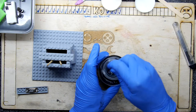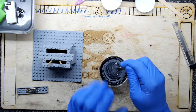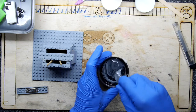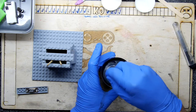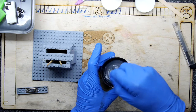And then the other thing is called a pressure chamber. You have to put the whole piece, so you put the whole lot in the pressure chamber, and what the pressure chamber does is basically crush all of those bubbles down, down, down, so they're so tiny they don't even matter to you anymore.